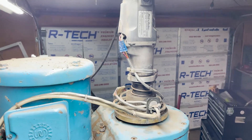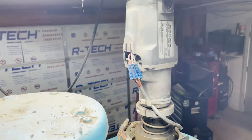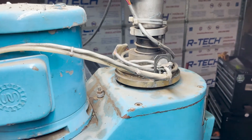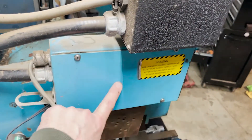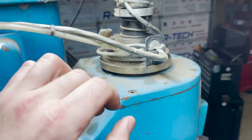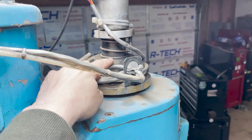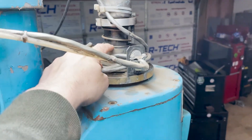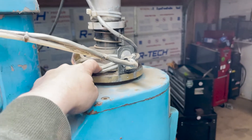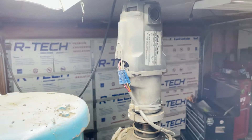What I have here basically looks like an old impact gun with the handle cut off, and that's wired where the trigger would go. It goes back into this box here and it's got an air hose on it too. When I hit the tool change button, this little thing drops down, the impact gun spins off the draw bar, and you hit the other button and it does the same thing only in reverse — drops down and spins on the draw bar. Neat little system, and it came like this — I did not do that.